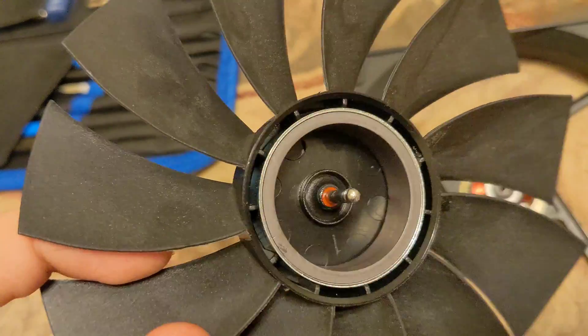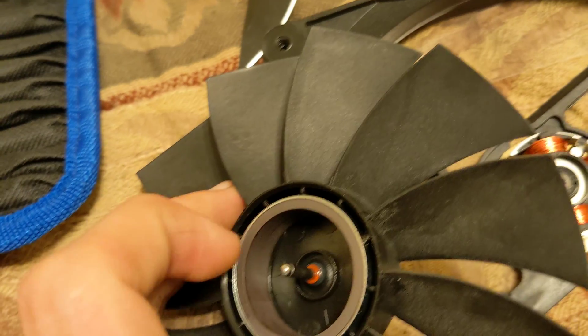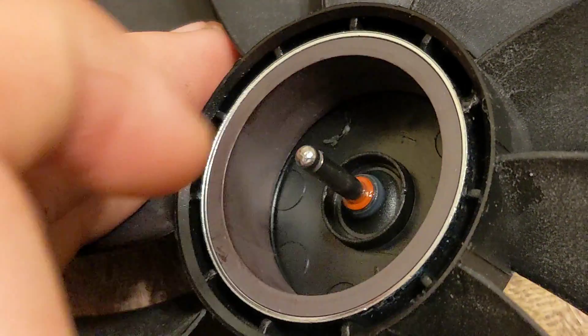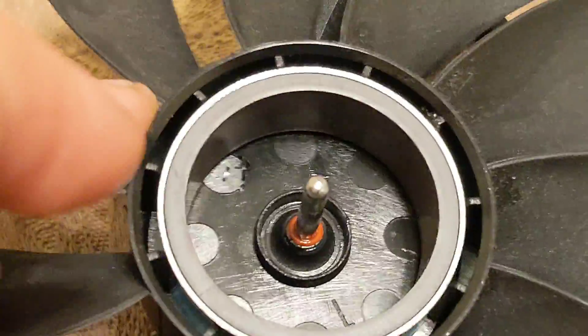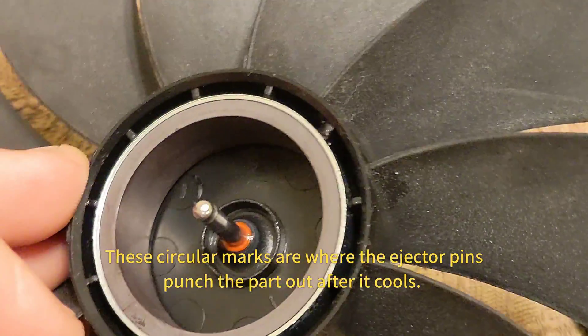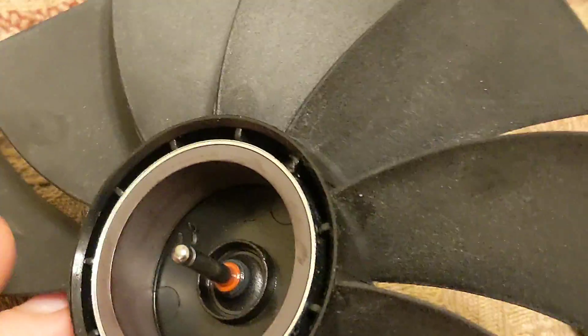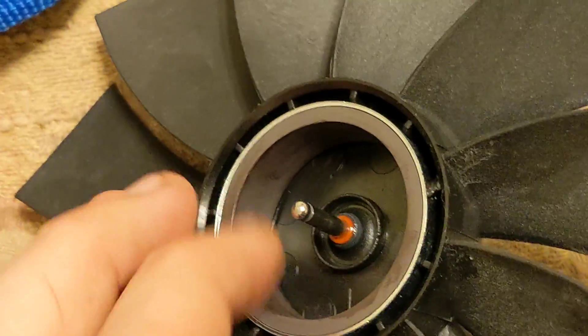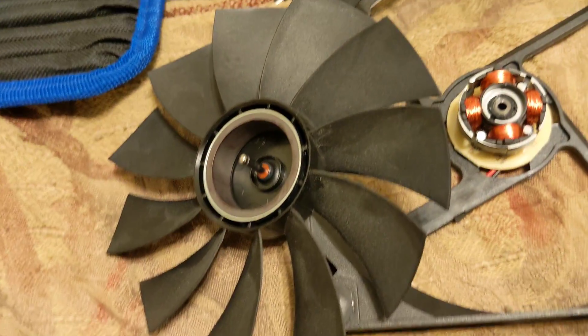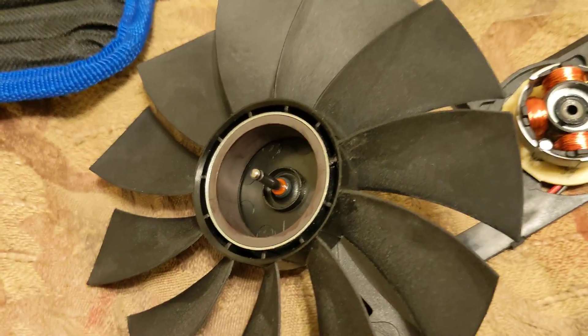It's making all that noise. Wait — that might be what it is. It's a little plastic tag in there — a bit of leftover injection molding. That's a nice ring magnet assembly — it's a ceramic magnet. Cheap, not very high flux, which means low cogging but also very low torque. For a little PC fan you don't need much torque — this isn't like a high-performance Tesla motor or anything like that.